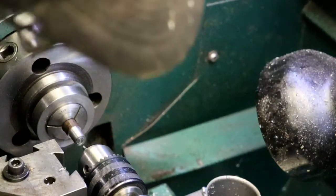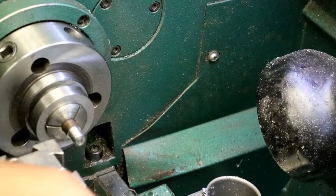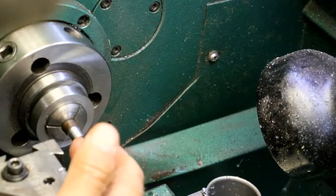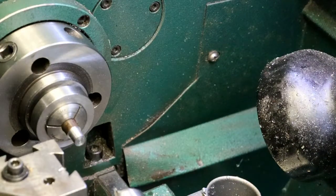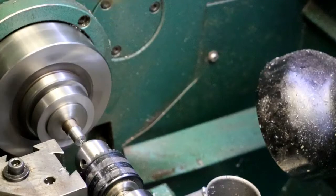Okay, I do have something underneath. My center drill was chucked between two of the jaws, laying down on the bottom. It's way on the outside here, and I'm going, whoa, that's way off center. So I thought my tailstock had something underneath it or something. That's better.